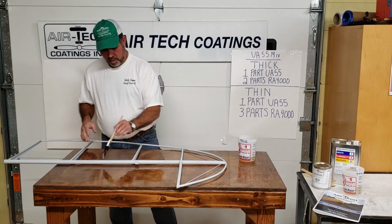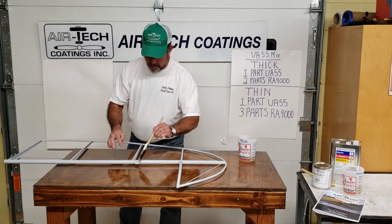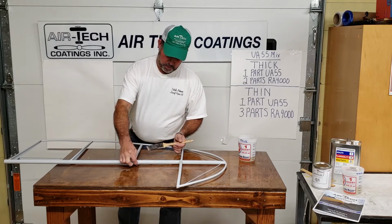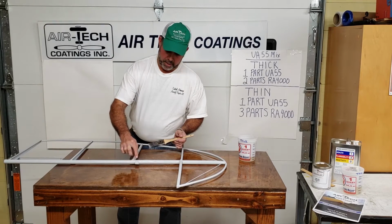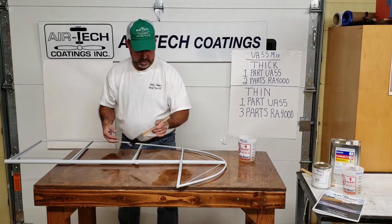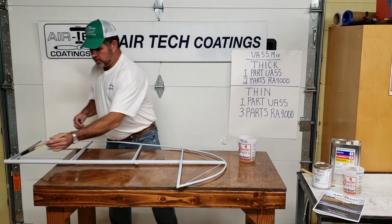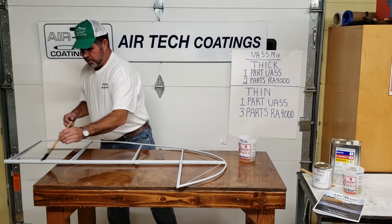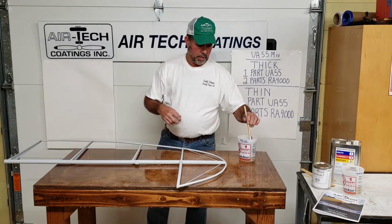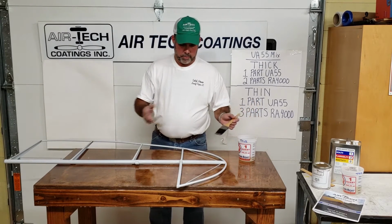But basically go over everything. When you get to your hinge blocks here, you want to get plenty of glue around them. Don't just get real crazy, because you're not going to be putting fabric around the end of that. You're going to have places you're going to trim, but you want plenty of glue so you don't have fabric sticking up. I'm going to get into that later as far as the little small corners that you don't notice till you're putting the final paint on and you're in a paint booth. You see these little areas and you start saying, man, I wish I'd have took a little time way back there and ironed that little spot down. It's really showing up now.